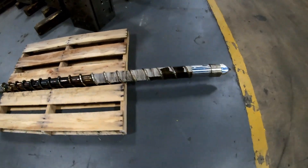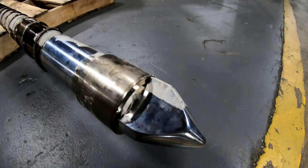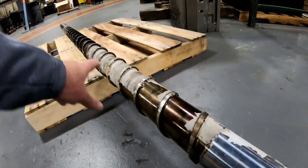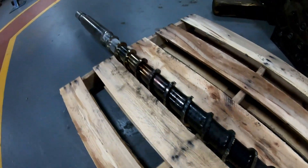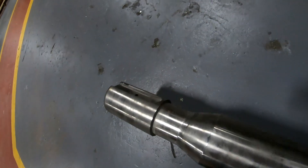Now I want to show you a real screw on the floor. Here is an actual screw — this here is the check ring, and you can see there's plastic inside of it. This is what it looks like. You can see how the pitches are: as you go back they get bigger and bigger, and you can see how deep they get. This right here would be your feed zone, and that's the spline where it gets connected.